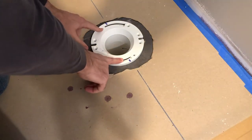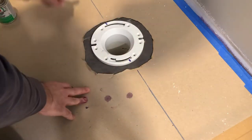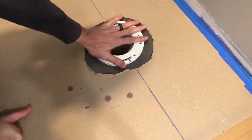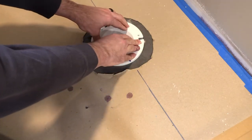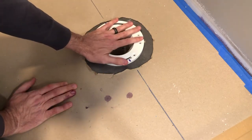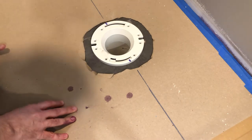We're done. This is definitely close enough - I may be an eighth of an inch too far forward but as far as my goal of 12 inches from the wall, I think that's pretty good considering what I started with. Now I'm just going to run some screws through here. There's really not any downward pressure here - the toilet sits on the floor and you just have that wax ring that sits on this. You almost wouldn't need to screw it down except there is some back and forth movement. You definitely want to have it screwed down to prevent it from moving around side to side - that could over time cause your wax ring to separate and then you would get sewer gas.